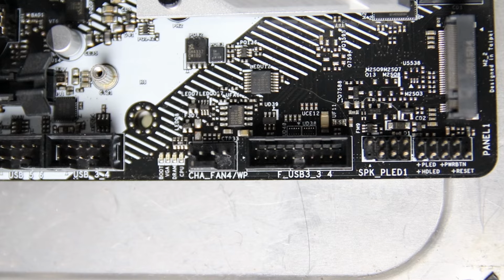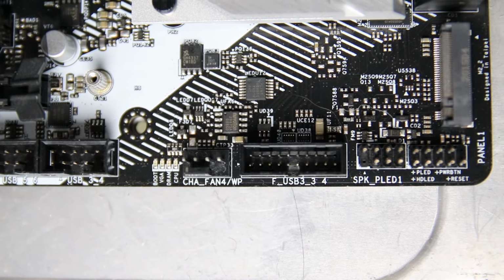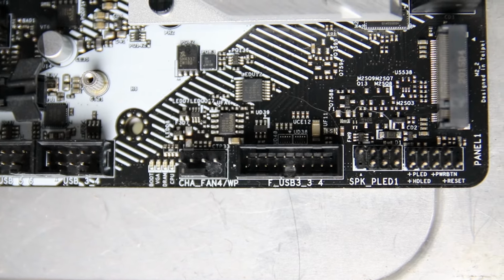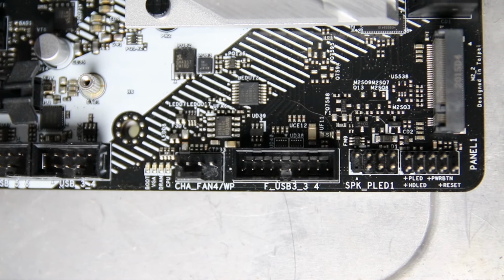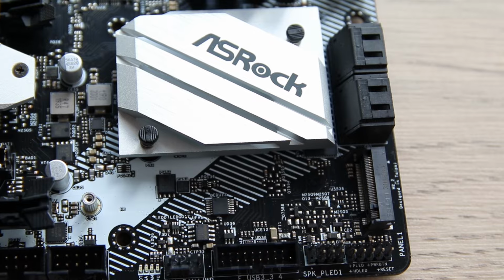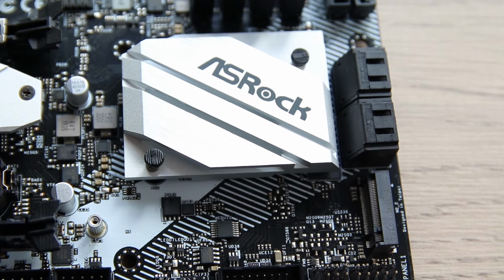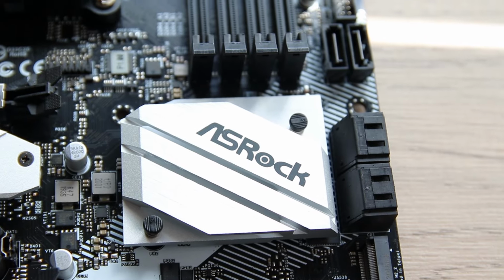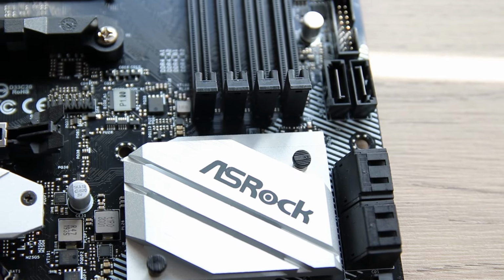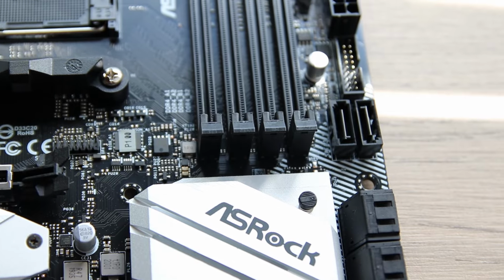We also have a header for speaker and power LED, which is right next to the front panel headers, which also includes a power LED, so that was a bit weird, but let's move on. The board comes with 6 SATA ports, which is surprising for an M-ATX board, and this is a full M-ATX board, so we do get 4 DIMM slots, which support memory speed up to 4533 MHz